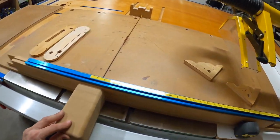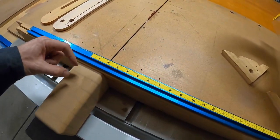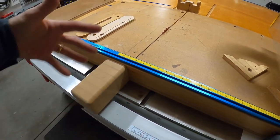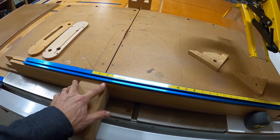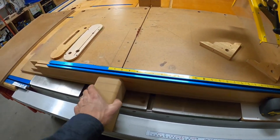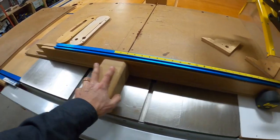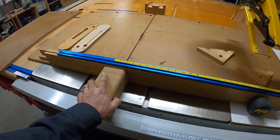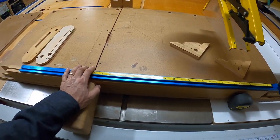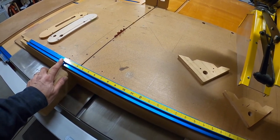It's really easy to do. I just stacked a bunch of pieces — this is one-inch or inch-and-a-quarter ultralight MDF — and ganged them up, gluing and gluing until I had a big block that I glued onto the sled. I made it round and eased everything so it's completely soft with no sharp corners that are going to hurt. Now I can use it as a handle — it helps me move the sled with just one hand. So anyways, this is definitely a sweet crosscutting sled.